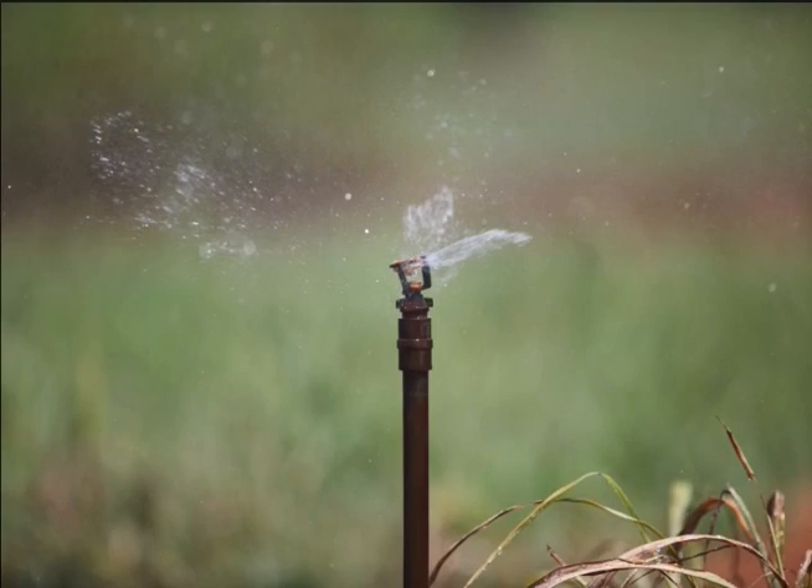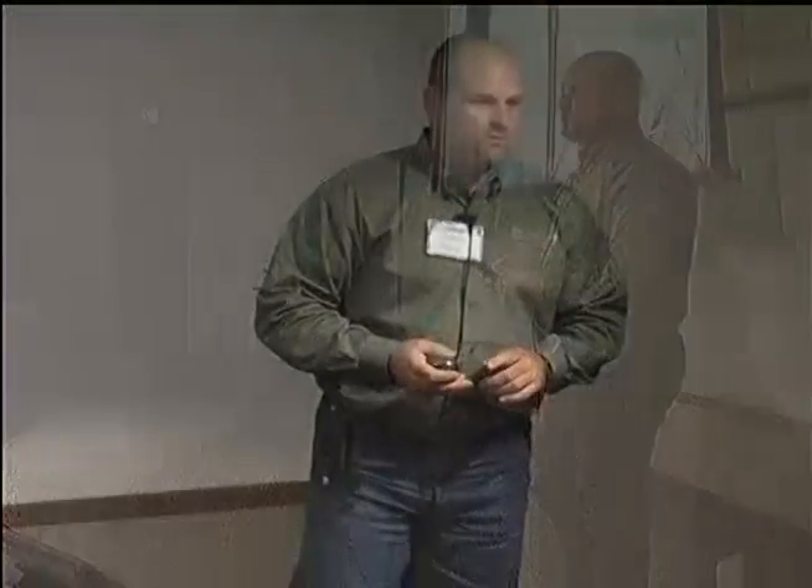Here's a little wobbler. Water comes up and hits this wobbling top, creating a pattern — it's not uniform each pass, but as it goes around you have uniform distribution of that water. The nice thing about this: if you have problems with high bicarbonates or calcium and some potential buildup, this has a bigger orifice so you don't have pluggage in the emitters.